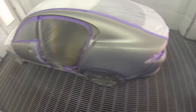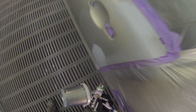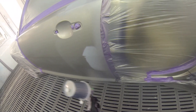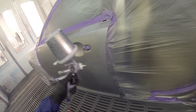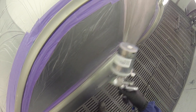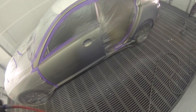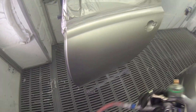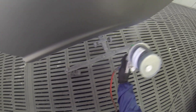Always, once you think you're covered, maybe just put that one extra coat on — especially with these colors that are a bit transparent. I've been stung before where it looks good, you think it's covered, you clear it off, take it outside, and you can see through it still. Just put one more coat or half a coat on — it's not worth redoing a whole job for an extra 50 or 100 mils of paint.